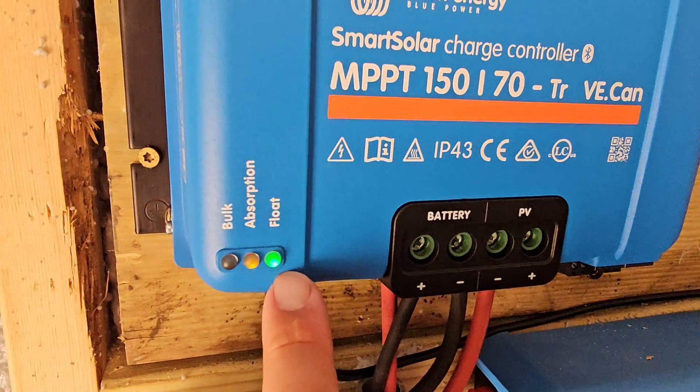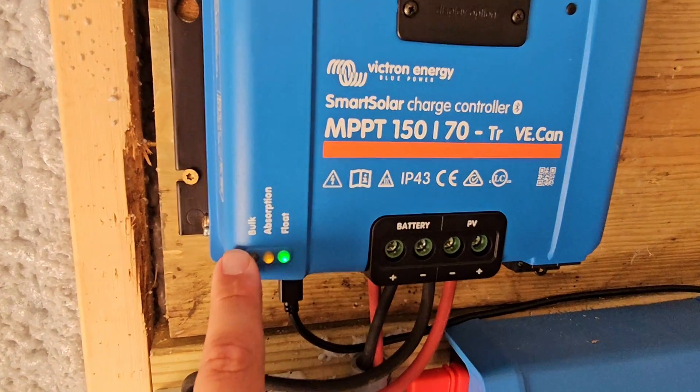It is not good to overcharge your battery — if you overcharge your battery, you can decrease the life of the battery. That's why the charge controller uses different stages of charging to efficiently charge the battery. There are LED lights to indicate which stage of charging we are in, whether it's bulk, absorption, or float. The first charging stage is called bulk charging. The charge controller uses the bulk charging stage to fast charge the battery, and it's controlling the current during this stage when the state of charge is very low.